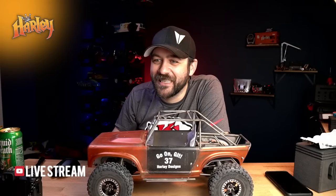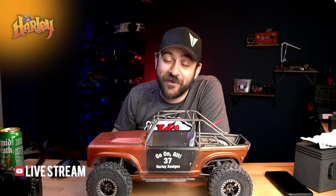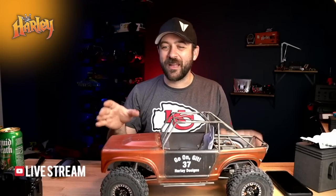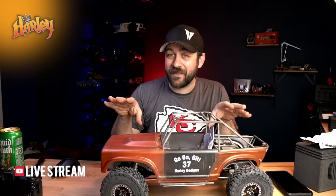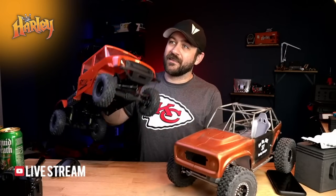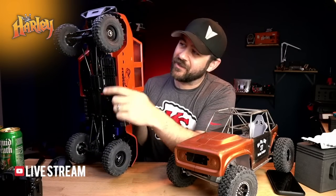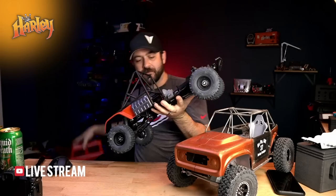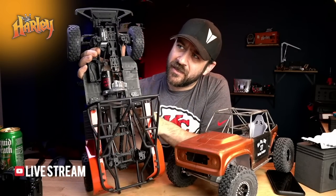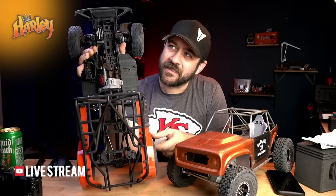Would be fun to build a dual skid long wheelbase truck where the links are short and the driveline basically has a carrier bearing to the rear. We had a couple of trucks like that back in the day, a little bit before MOA or when MOA was at the start. This has a carrier bearing, Libby. This is long wheelbase. This back here, the carrier bearing goes to an intermediate shaft that goes right there, and then there's the rear drive shaft. There you go. It's basically what you're saying.